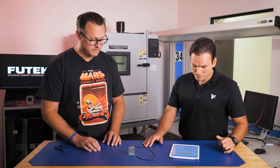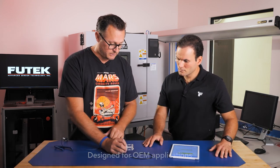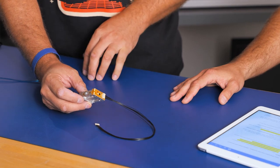Sure, so a little bit about the LSM305. Like Ebenezer mentioned, it's come off of the LSM300 that we've had for numerous years. Probably the first thing you're going to notice is these little dog bone shapes inside of the part. We put the strain elements on all four sides, and through the shape and design, we've been able to really hone in on optimizing the stress locations.